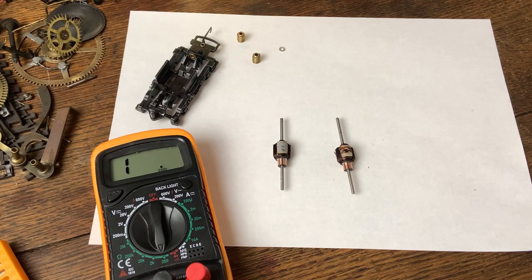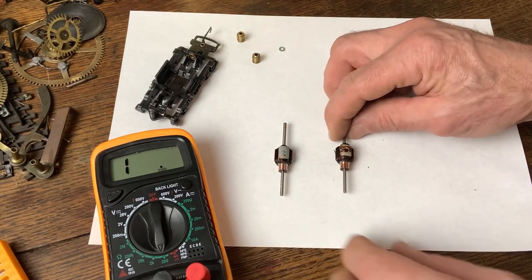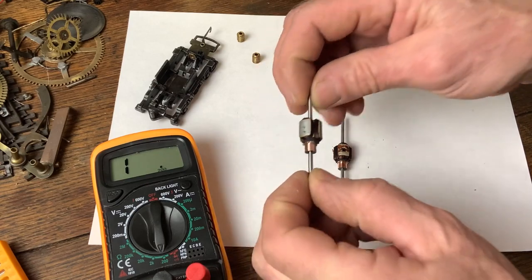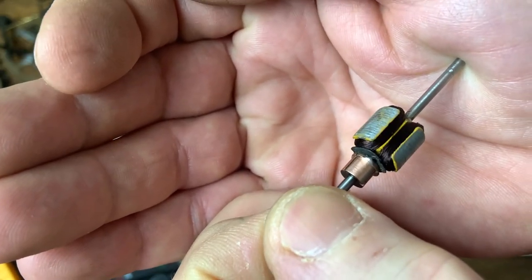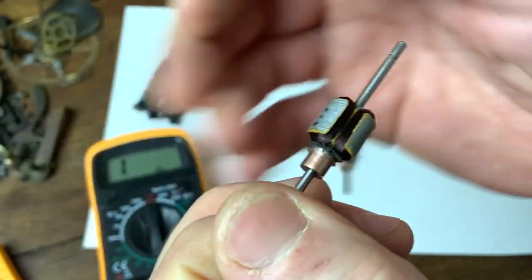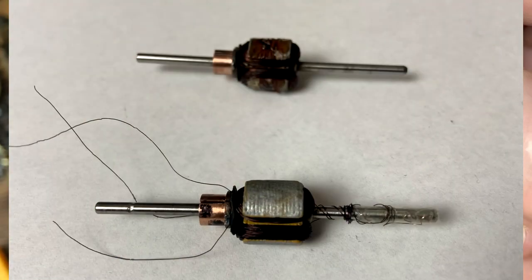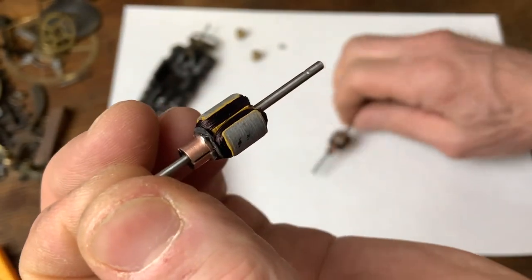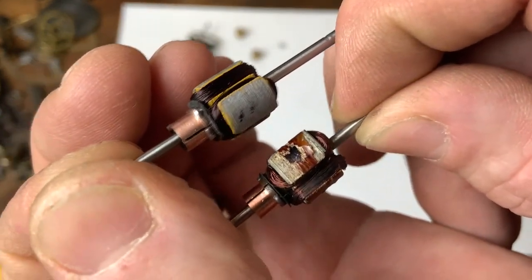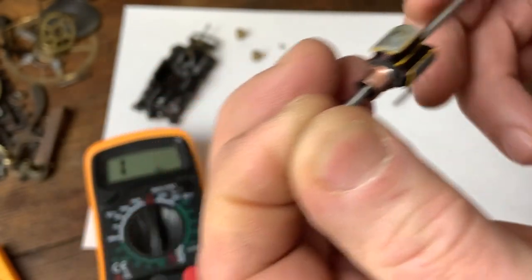Hello and a really warm welcome to this video in the series of armature rebuilding videos I've been doing recently. Thanks for looking in. Since the last installment I've got a rewound armature - I've managed to get the last two pole pieces wound, the commutator on, and the wires soldered. If you look at the inset picture over the top of the video track you can see just after I'd finished winding, with wires sticking out. There's my rewound armature and here's a Triang one in comparison - they're very similar except mine's a much nicer color with that yellow.